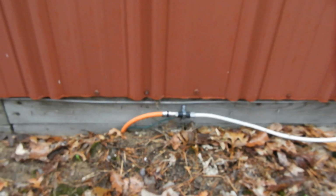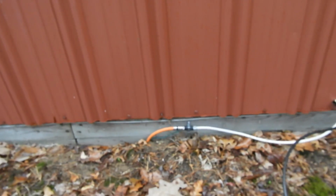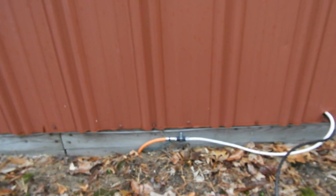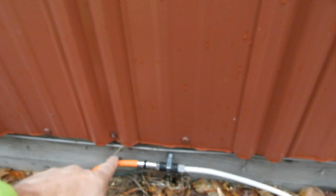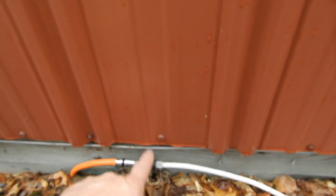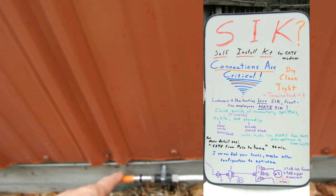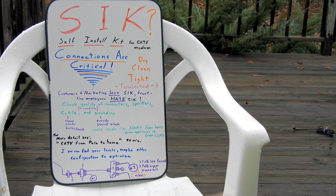Potentially, in a worst possible scenario with the power company, the cable, up to the ground block, could all go into flames. I've seen it happen in a severe electrical mishap. So the cable from the ground block out needs to be routed out of, not inside the house certainly, and away from anything extremely flammable. That's about it though. If you need more information, see my other video.